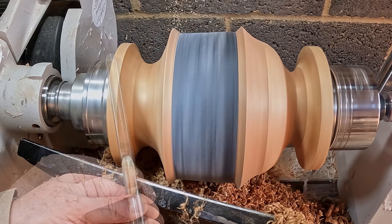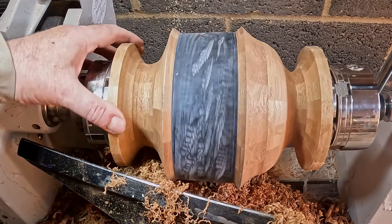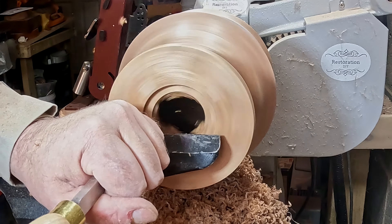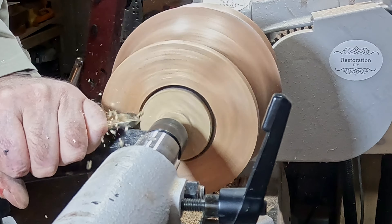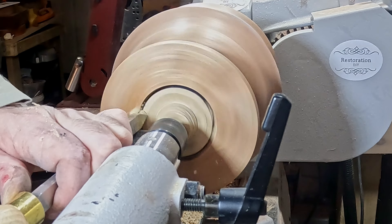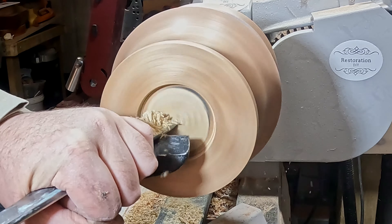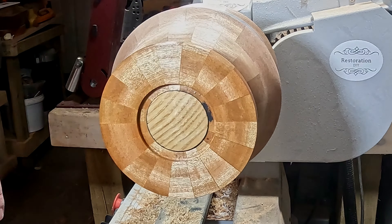Just a hole in the base to fix and the top of the rim to finish. I sanded with 80 grit to check for any ridges or low spots. Off camera I made a circular plug for the hole in the base. With the tailstock removed I opened up the hole and glued the ash plug in place using black-coloured rapid-setting epoxy resin, allowed to cure for 30 minutes, then cut it back flush with the base. Then I sanded just the underside from 80 to 600 grit and applied a finish, topped off with Hampshire Sheen Gloss Finishing Wax.